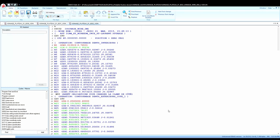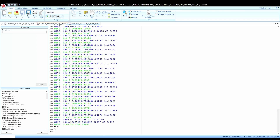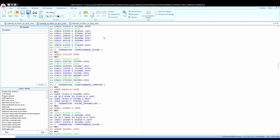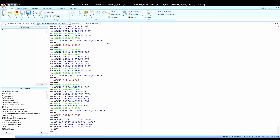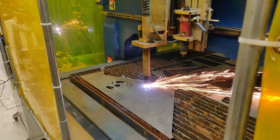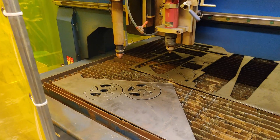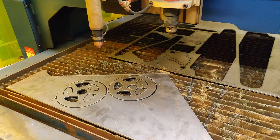Here are all the programs related to the fabrication of the piece. At first, when we were cutting on the plasma, the torch would clip one piece after it had cut it. Because of that, we had an offset in between the cuts, but we were able to fix it.